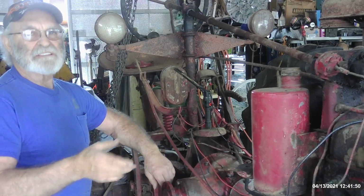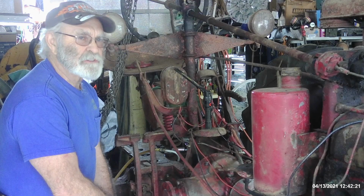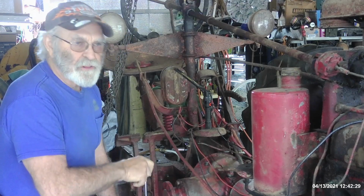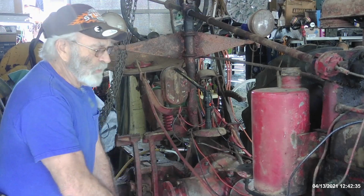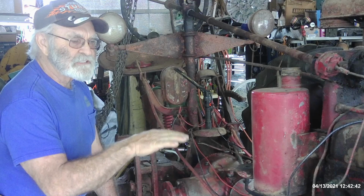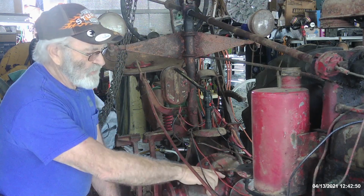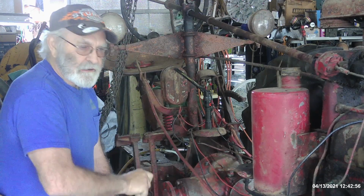Today, we're going to start the process of finishing up this whole thing. For right now, what we're going to concentrate on today is pumping in 26 quarts of 80W-90 into the rear end and final drive. I think it's going to take, as much as I can tell, 26 quarts to satisfy the requirements for the transmission final drive, and then also a little bit for the side belt pulley up here on the top. It does not have a separate sump. It has its own level, but it's common to the final drive, the transmission rear end. I've already put about a quart in that sump up here via that one fill hole, and I'm going ahead and pump in the rest here in the back.